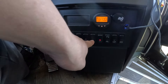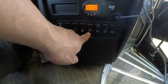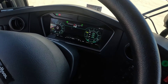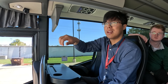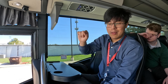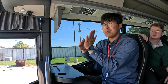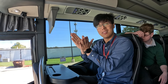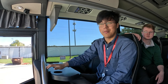This is the 110-volt outlet switch — pushing it down turns on all outlets on the coach, allowing passengers to recharge their devices. This is the fast idle button, which causes the RPMs to rise. On some coaches, if you hit it twice it'll go to an extra high idle — somewhere between 1,200 and 1,500 RPM — but it depends on how the coach is equipped and the engine type. Normal fast idle is a little under 1,000 RPM on some models.